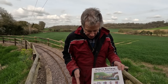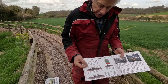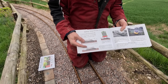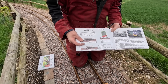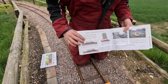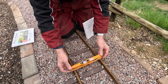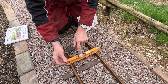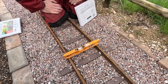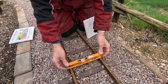I'm down here on the embankment on a fairly tight curve and I've got with me book three, The Forgotten Engine. Looking inside at one of the technical pages, it's about banking up the track on curves — a spirit level showing the track being level, and here the track is canted over a bit. The idea is that when you're going around a tight curve it helps the engine go around the corner. You can see I'm using a spirit level to measure how much the track is canted. When it's absolutely level the bubble will be between the two lines, and you can see there's quite a good degree of banking as we go around here. When I finish the whole repair we'll have a demonstration with the engine running around and the spirit level on the train, to see how much it changes as we go around the different curves.